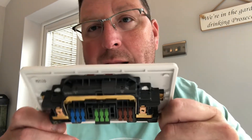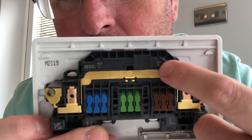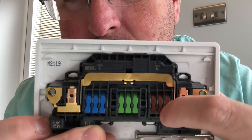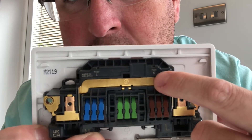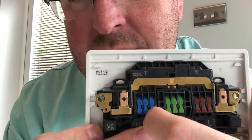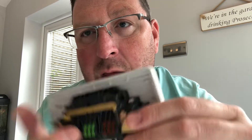The other thing I quite like is they've actually thought about putting a test point at the top. Rather strangely it's on opposite sides — you've got your live conductors going in here but at the top you've got your neutral test point, and over here you've got your neutral conductor insertion point but your live test point. We don't need an earth test point because we've got the whole of this bar, and you can also use a plug-in adapter at the front if you wish.